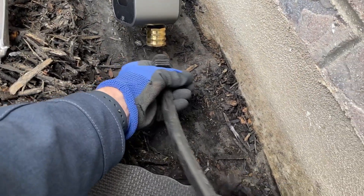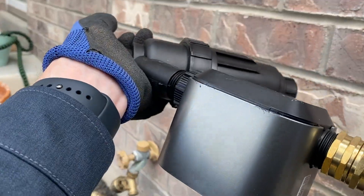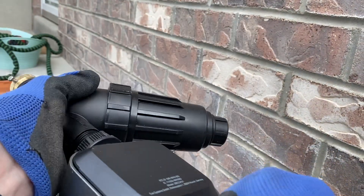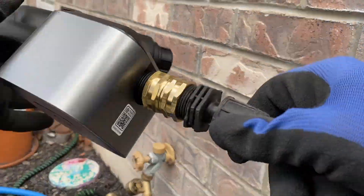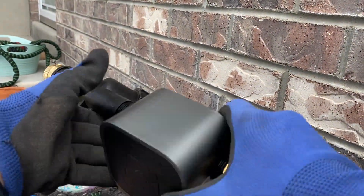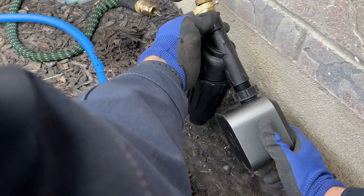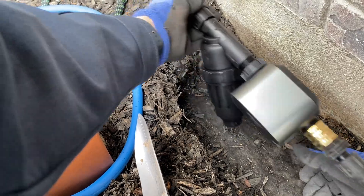What I connected to the poly was a male garden hose thread attachment — you'll see it abbreviated GHT. Those are the thick, wider garden hose threads. You just get two female-to-female adapters to connect from this. They also come in male-to-male in a nice package of brass so it lasts longer. All of these connections have a flat o-ring on the inside, so when you screw it together the hose connects to that o-ring and creates a watertight seal. If it doesn't seal properly, you can add some plumber's tape to the threads — go around several times, I like to go around seven or eight times, and that will help you create a watertight seal.